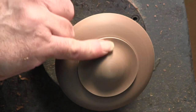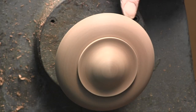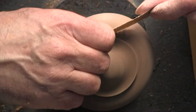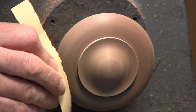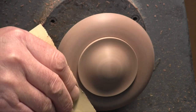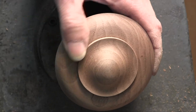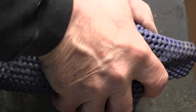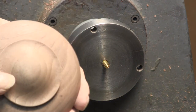The final thing we do is just break the sharpness off of this edge. If you don't break the sharpness off of the back edge — not the face, because that's going to be applied to a flat surface — you'll leave a sharp edge. And there's the finished rosette.